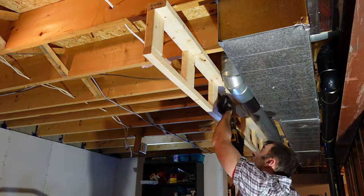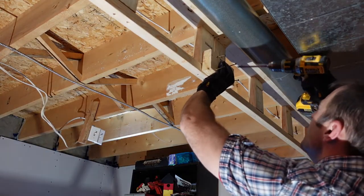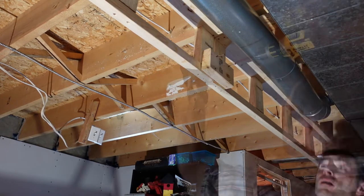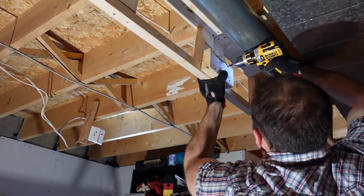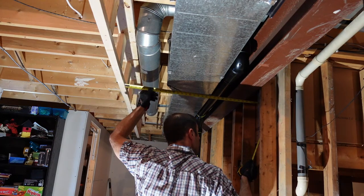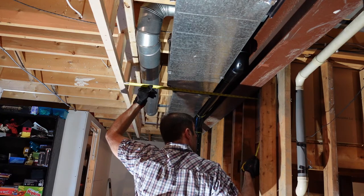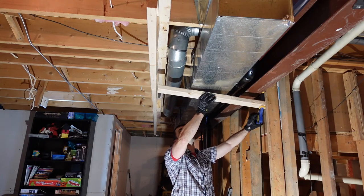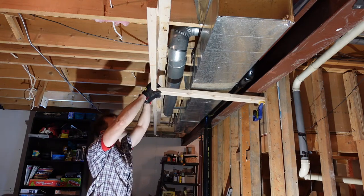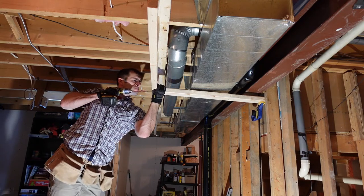Because these two pieces are independent of each other, I don't want any drywall to split on that seam. So I'm taking a chunk of two-by-four and screwing it onto the back of each ladder section to connect them so they won't move independently. Next I'm measuring the distance from the ladder framing to the drywall on the staircase wall, and I'm putting in a couple of two-by-fours along with two-by-twos for the horizontal members. I'm running the two-by-four sideways, which is a bit unusual but keeps the framing as tight to the duct as possible — running them vertical would lose at least an inch of height.